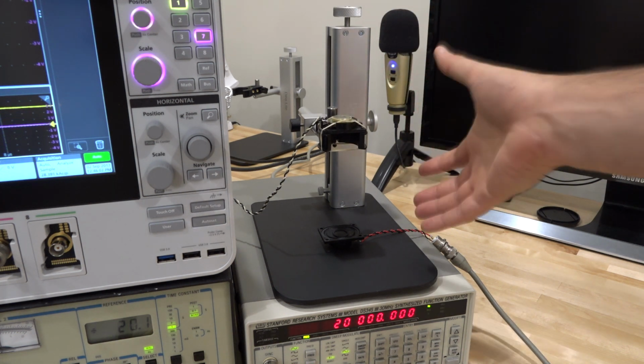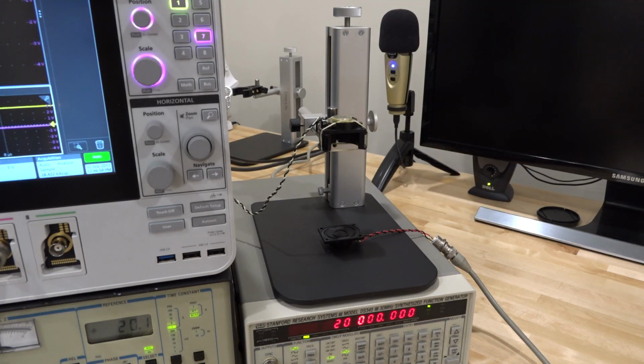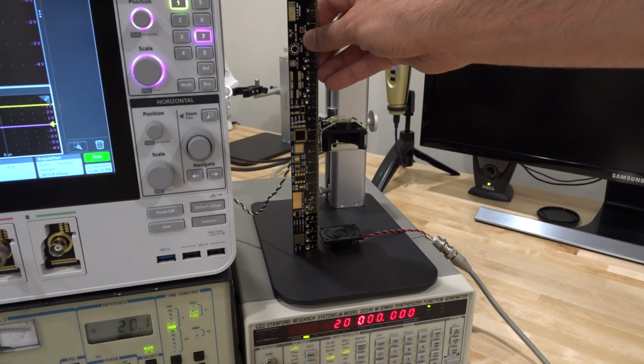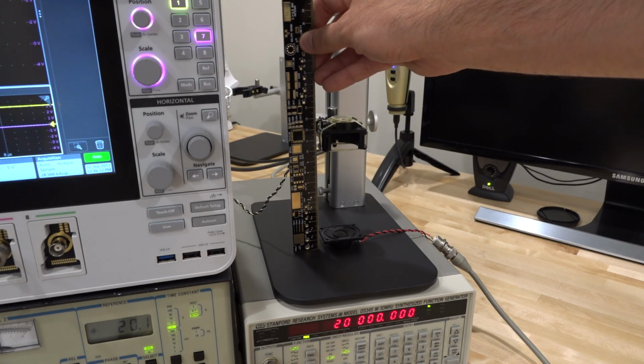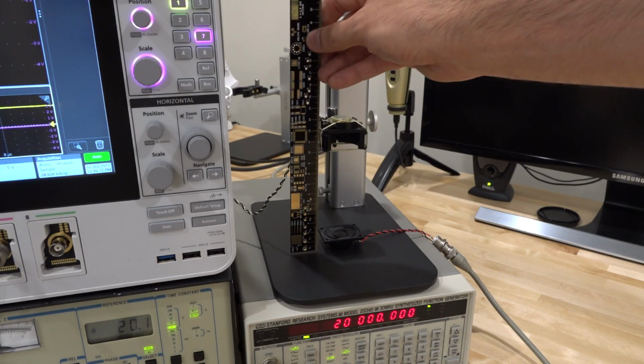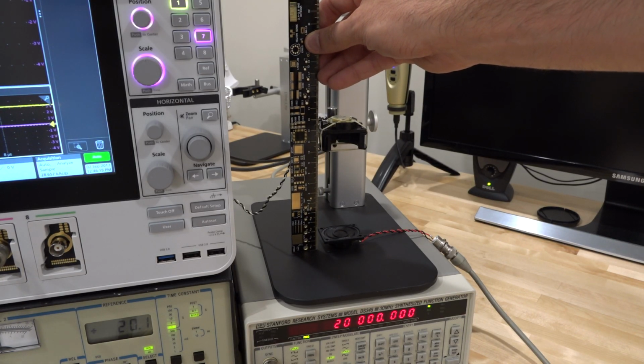So this is very simple. This is from my microscope setup actually. And I can then take a ruler, and I can put a ruler right over here and make a reference distance measurement, and then make another measurement once I have accomplished 360-degree phase shift. And here I'm using centimeters because I'm not insane. And from that, we can calculate the exact wavelength.